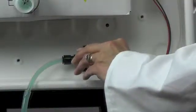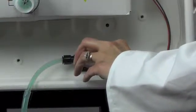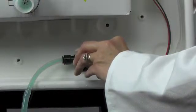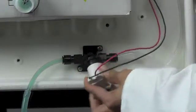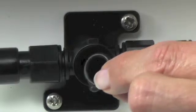And then we need to give this valve a quarter turn upwards. Before we do though, there's a little black O-ring that needs to stay in the pipe, so please be careful when you remove the valve that the little O-ring doesn't come out too. There may just be a little bit of seepage that can be wiped away. Here's the O-ring I mentioned that needs to be placed in here.